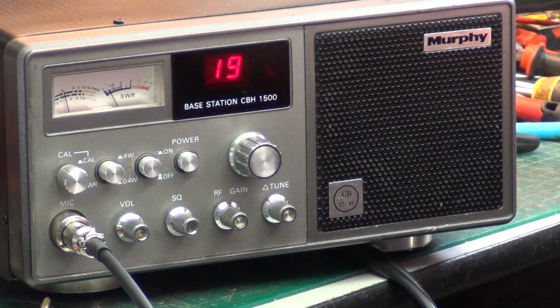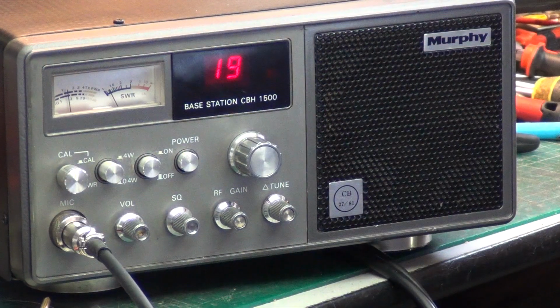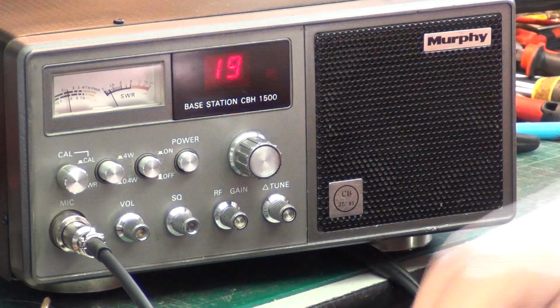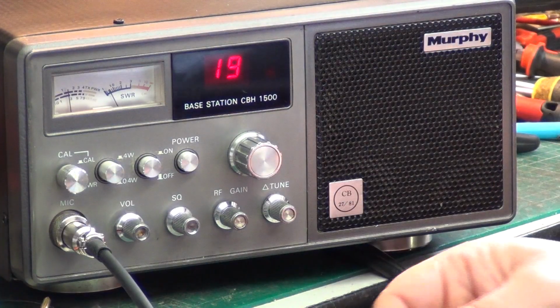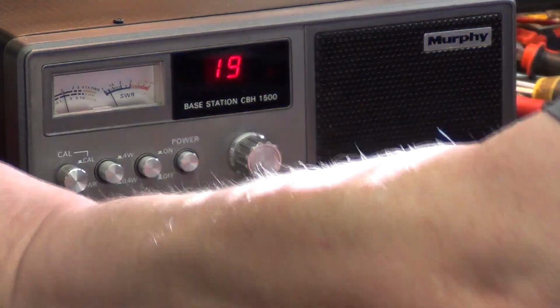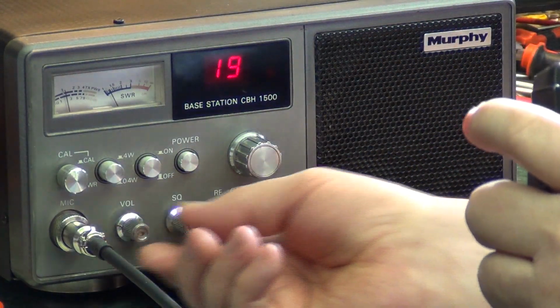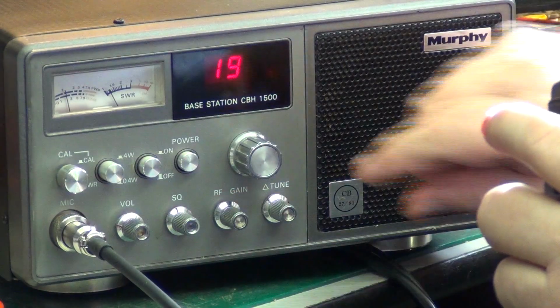Now, the power supply capacitor is 1000 on these normally, and we put in 2200. Now 4700 is absolutely as far as I would take it, because you can end up with surge problems with diodes and things. But anyway, so does it hum? We're going to find out, because you know what, the last one didn't. But it doesn't mean this won't.